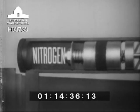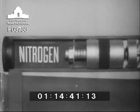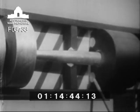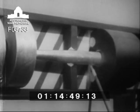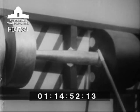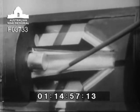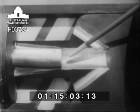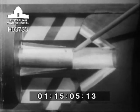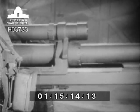Now the compressed nitrogen gas takes over and counter recoil starts. The gas expands against the floating piston, driving the oil back into the recoil cylinder. The one-way valves are closed, and the oil is compelled to return through the central bore of the regulator body, bypassing the cylindrical head of the control rod. It flows through two tapered grooves, which gradually decrease in depth. Thus, the head of the control rod, as it moves forward, causes the oil to pass through smaller and smaller channels. Finally, the grooves end altogether, and the head of the control rod shuts off the flow of oil, returning the piece to battery without shock.